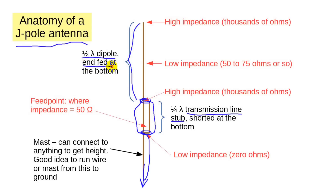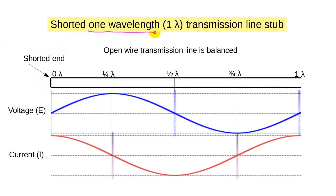This is the part of the antenna that radiates. There are lots of interesting things going on, so let's explore this more thoroughly. I want to start with the quarter-wavelength long matching stub, but let's begin with a more general discussion of transmission line stubs. This drawing shows a one-wavelength section of two-wire or two-tube transmission line on our band of interest. J-Poles are usually single-band antennas, most of the time for two meters, so a one-wavelength section is about two meters long. We assume no ohmic losses. These two thick black lines represent the conductors — either wires or tubes — used to form the transmission line.